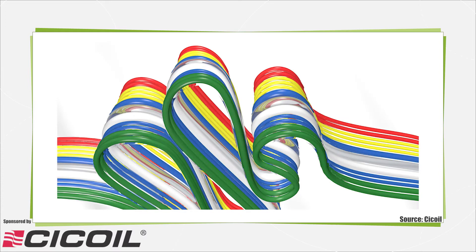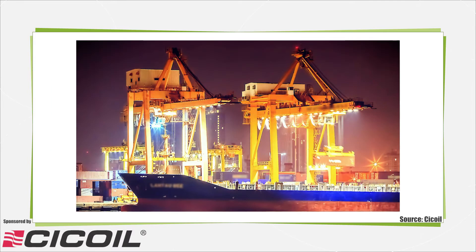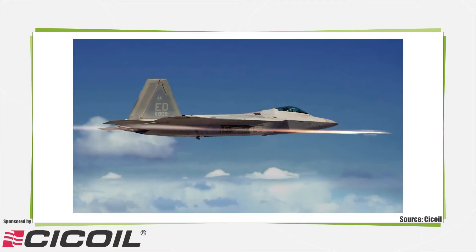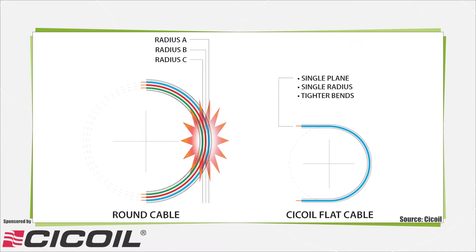Because of their flat design, flat cables are more flexible than their round counterparts, especially in high-flex applications such as robots, festoon, and automated processing equipment. They are also suitable to military, aerospace, medical, and cleanroom systems. This flexibility can be attributed to the fact that flat cables flex equally and in the same plane, reducing the twisting and stress put on round cables.